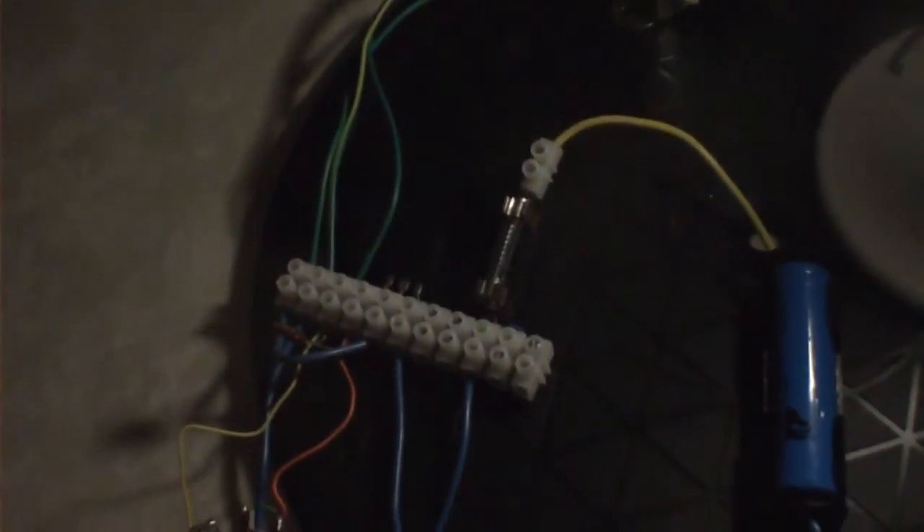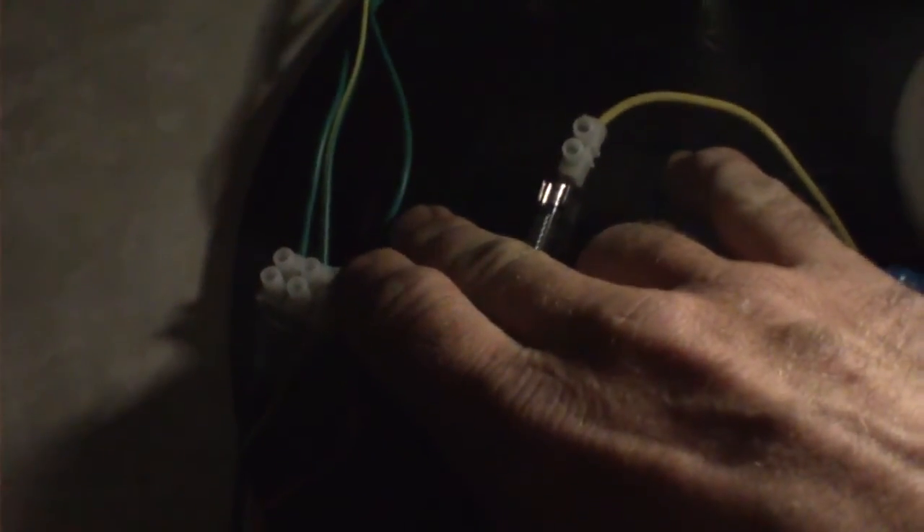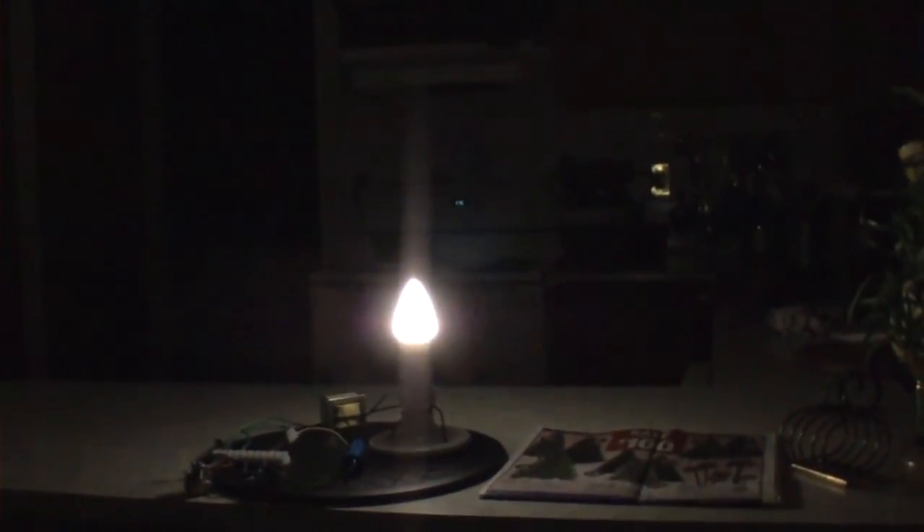So that's it for now. I'm running on a TIP3055 and I forget how much resistance because I've got a pot in there, so I'm not entirely certain right now. I'm going to play with it for a little bit. It's cool as can be — there's no heat on that transistor at all. I did the math: it's under a watt, and that was with an analog ammeter. Not bad. Thank you very much — great circuit, great circuit.